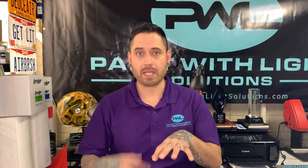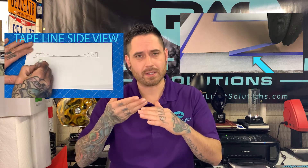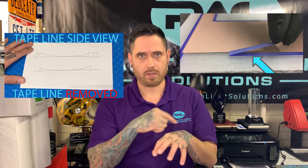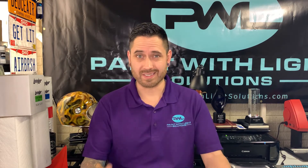A known weak point in the system is the back plane edge. During application we teach to cut down the edge of the back plane after you unmask it, because the paint edge against the tape leaves a sharp edge after you pull the tape. You need to sand that off — otherwise you'd be creating a fuse along that edge due to improper insulation, which is an area where we know a fault or weak point already exists.